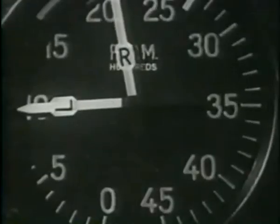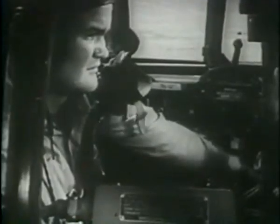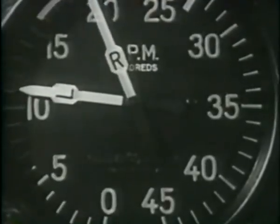Next, turn off one magneto. Your loss of RPM should not exceed 100. Now make a quick check on the other mag. Running an engine at high manifold pressure on one mag may cause serious detonation. Next, test the prop circuit breakers. Pull the prop governor control lever back from its high RPM setting until it drops 200. Advance the prop control to the original setting.